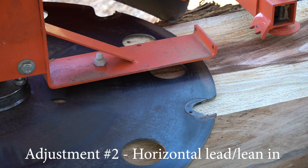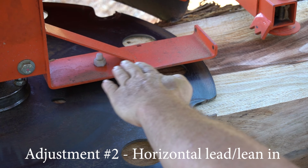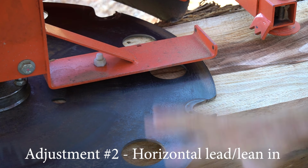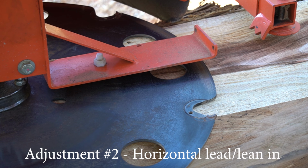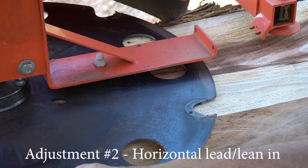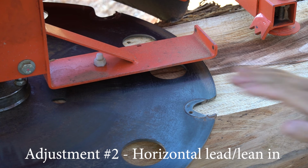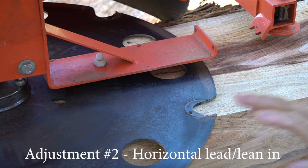Now that's terrible. To have a negative lean like that, it means that the blade's going to grind up against his face every time you move across, heating up the blade, cutting wonky timber, all sorts of variables, you know. So you've got to have a good tilt, or at least flat. But I like to have a little line between 2 inch skims. So we'll take it back, lower it down an eighth of an inch, skim, go back, and we'll check the difference.